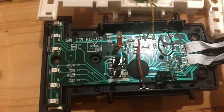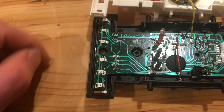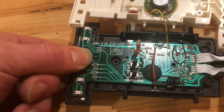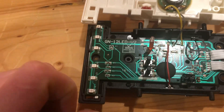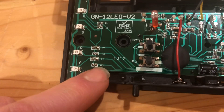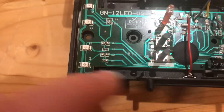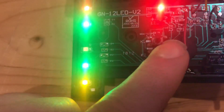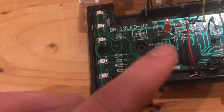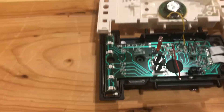I hope this video helps some of you who might want to get this to just run continuously in a display. I'm going to be potentially adding more twinkling lights, and for that I'm going to just tack extra wires on the back side of the resistors here, because once it goes through the resistor it is limiting the power for that one LED. But prior to going to the resistor I should be able to tack on more LEDs so that I can get some more of the light effects.